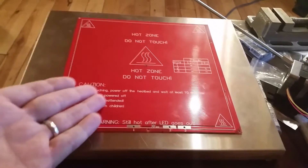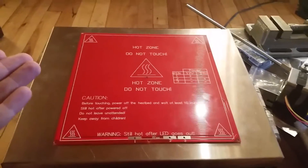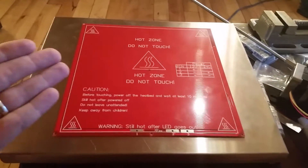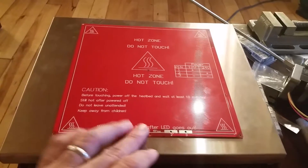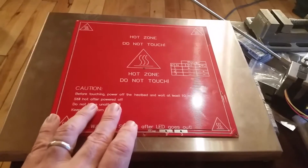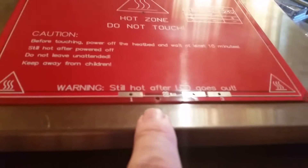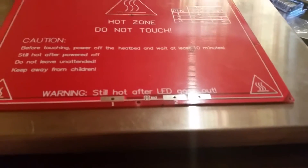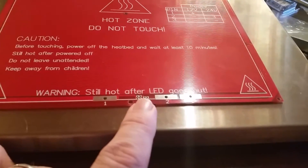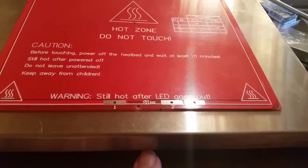It comes out flat. So if you've ever ordered one of these Chinese heat beds and it arrived with the corners bent, it's just a simple bake in the oven at 250 degrees. Make sure your oven's temperature is accurate because you don't want to burn the board. Make sure they haven't put anything on it yet — a brand new naked board can be flattened very simply that way. Make sure the LEDs and resistors have not been added and that there's no solder. I'm using stainless so it wasn't going to stick to the board once it cooled down.